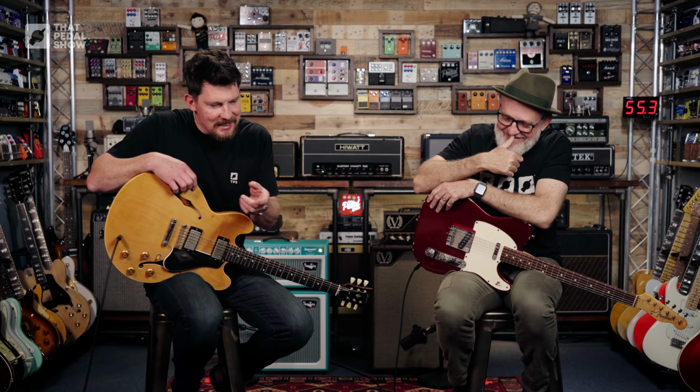Well, okay, so what the Analogue Man ARDX20 does is it uses control voltages to do what Dan has just done. Exactly. Which is gently manipulate the delay time, which is what gives you the modulation. That's really cool. There you go. Zach, get on it, mate. That's awesome. How cool. Yeah.